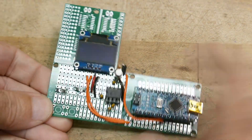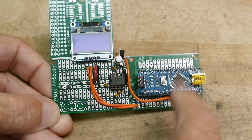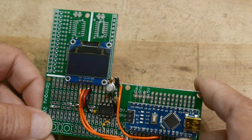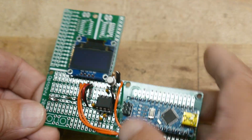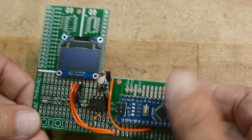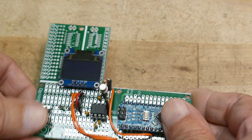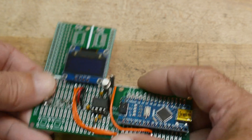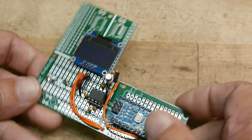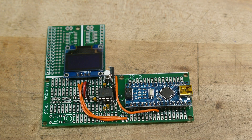I had built this little board to test out my prescaler and it had a little display and I made it into a little frequency counter just to play. I thought that would be a nice little board to do — maybe somebody out there would enjoy that — so I decided I would go ahead and design a little thing, make this into a standalone object on a nice PC board. I could also bring out the I2C lines and make this my separate frequency counter with I2C output.